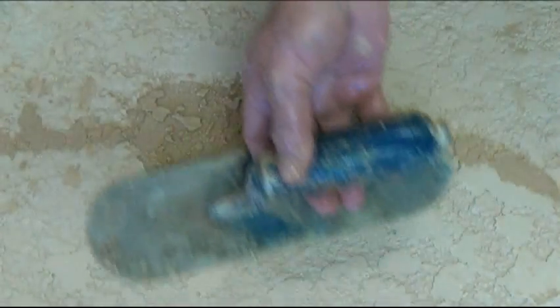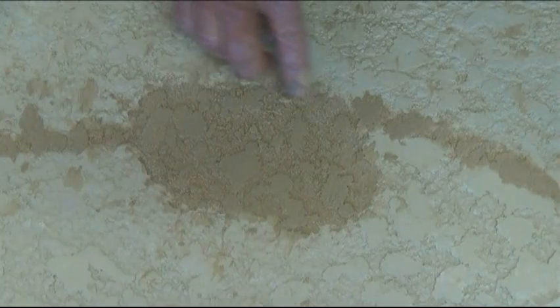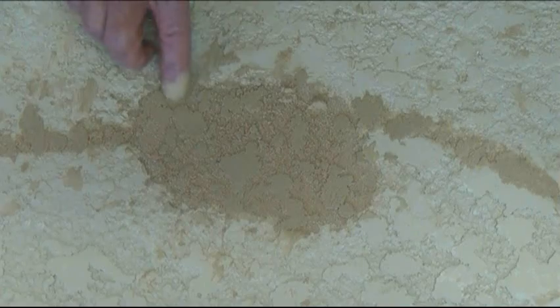You want to lightly trowel, barely allowing it to touch, with hardly any pressure whatsoever. And if it's not quite ready, if it's sticking to your trowel and kind of slurring, then you wait another half minute usually. But this one was all ready to go. It was drying out just right. And so we're troweling in different directions and critiquing it, seeing if any other places need a little bit more.